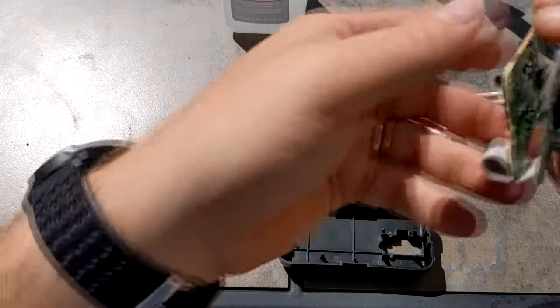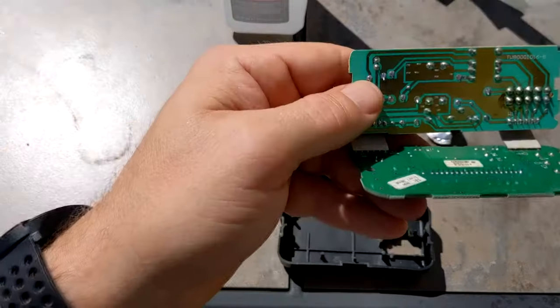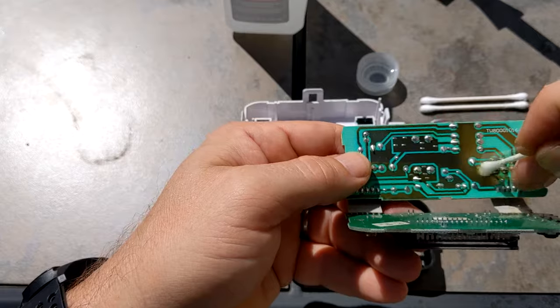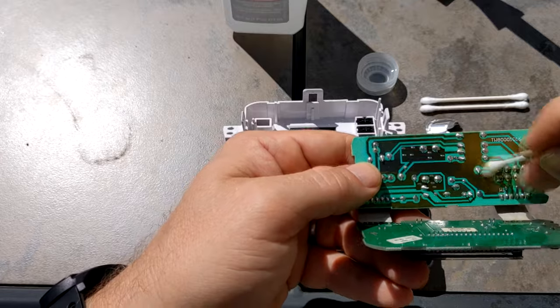Look on the gold printed circuit board — you might see some discoloration from solder that's melted. I cleaned this up with some rubbing alcohol, just gently. Make sure you don't get any cotton fibers staying behind. And that might be enough to fix it for you.